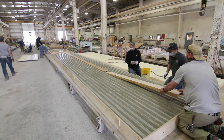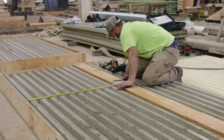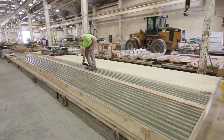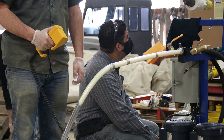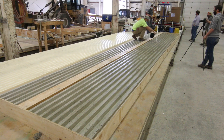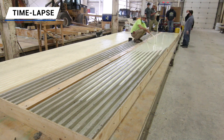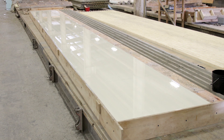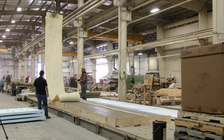For this project, Slough Precast required some liners that were not as wide. New mold walls were added to the master to create the smaller liners. An additional coat of Sonite wax and more universal mold release are applied to the master. The easy mix machine is prepped and recalibrated prior to pouring liquid rubber onto the master. A total of 900 pounds of VitaFlex 60 was poured for the smaller liner in about 30 minutes. The rubber is allowed to cure overnight and the demolding process is repeated. More liners are poured each day to fulfill the requirements of the project.